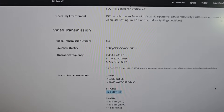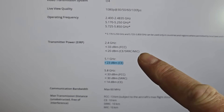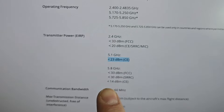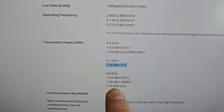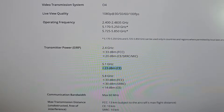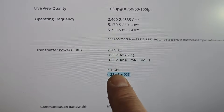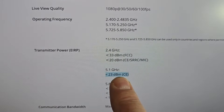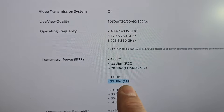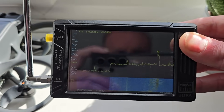I've just looked at the DJI Avata specs online, and we can see there are actually three bands that this thing supports: 2.4, 5.1, and 5.8 GHz. Interestingly, if we look at 5.8 in CE power mode, that's basically 14 dBm, and that is 25 milliwatts. On 5.1, it steps up to 23 dBm — I thought that was just over 100 milliwatts, but actually I'm mistaken — it's 200 milliwatts. So there's a 5.1 GHz band that you're allowed to run 200 milliwatts on. I wasn't aware of that. So I suppose we'd better test that then, because I wasn't covering that on the first test. I've got from 5 GHz to 6 GHz to make sure I don't miss anything.